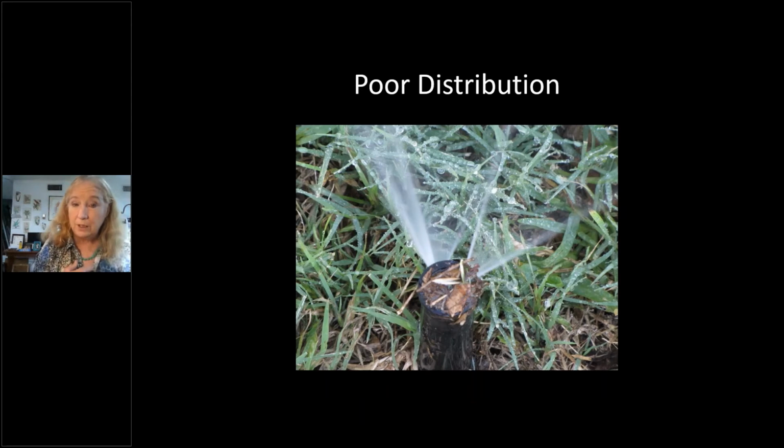And I'm predicting what is interfering with it are grass clippings and leaf clippings getting through that wiper, and then the power of the water coming back up through the nozzle, through the irrigation system and pipe, is stopping your nozzle up. And so this needs to be marked in such a way that you're going to go back to it and pull the riser up, and you're going to take the nozzle off. It should be real easy to do.